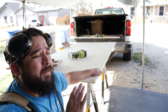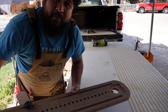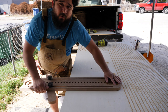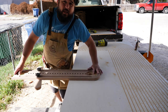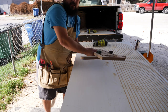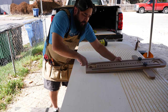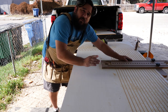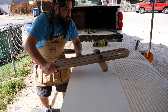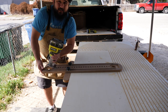Now we're going to do the easy side, which if you're facing it is the left side. The router should ride down it pretty easily. The other adjustment I made to this jig is I made two holes for the router. The rounded edge is the one you always want toward the center. I'm going to be cutting down the left side — easy. When we go to that side I don't want to turn it, so what I did is I just made this jig slide down and use this second hole. The router is still facing the same direction, just going down the other slot. I just bring it this way and use the router this way — still the same direction.